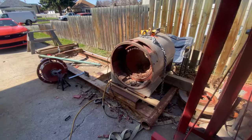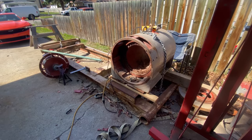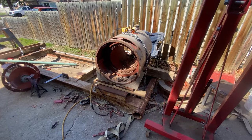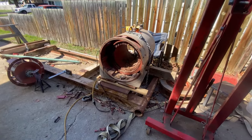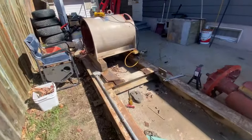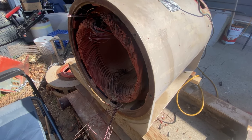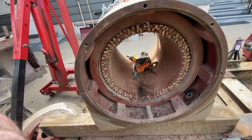Looks like the weather's going to cooperate. What I did today was unbolt that stator from the skid, because no matter what I did I was bending up come-alongs and nothing was working. I figured if I've got to remove the copper the old-fashioned way, I need this at a better working height - because bending over for hours at a time doesn't work. So now I'm just going to cut this other crown off. Hopefully this will loosen it up and we can get some production. We got the second crown cut off, which was a little bit of a bear.